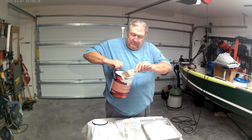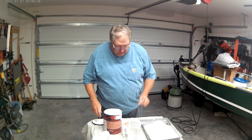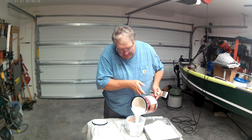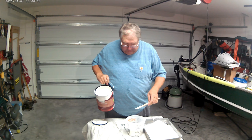Always take your brush and clean the drips that come after you pour, otherwise it's going to run down behind the paper label in your can and end up on the floor or table or whatever surface you're working on. We're also going to pour the cutting bucket about a third to a fourth full — this will be the paint we use to cut in with when we cut the edges of our wall and down at the trim.